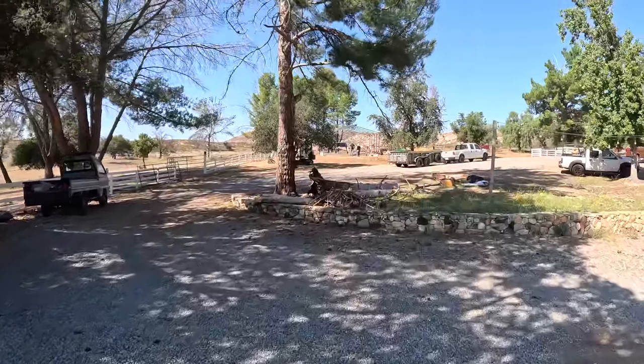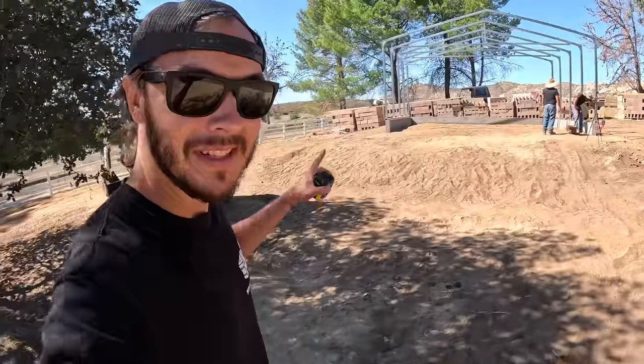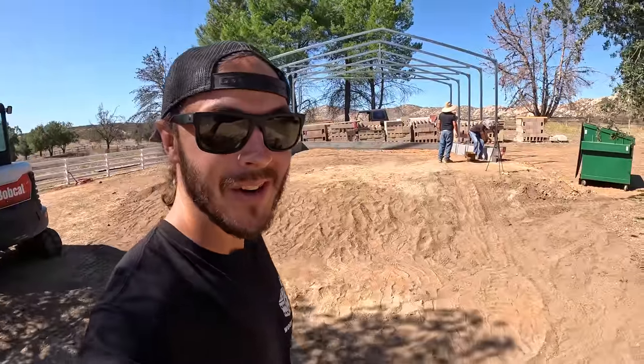She is up. This is what she looks like from the house looking out. It's looking pretty good. Obviously, it's going to look even better once we get that nice, beautiful gray roof on it. Pretty excited to see that. But she's pretty big. She's tall. We're up on stem walls right now, and one side is almost 18 inches of stem wall, which is pretty significant. By putting in these stem walls, we can basically make any height carport that we want.